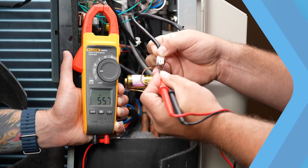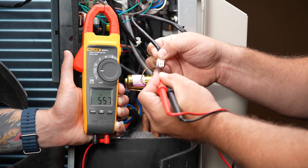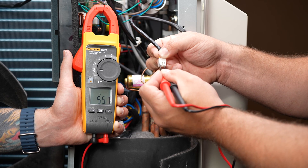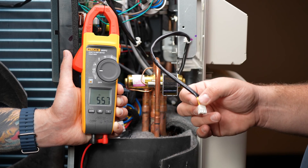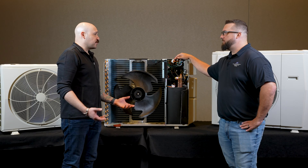This is testing out as a good four-way valve coil, between 500 and 600 ohms resistance for a 24-volt DC coil on a Daikin.